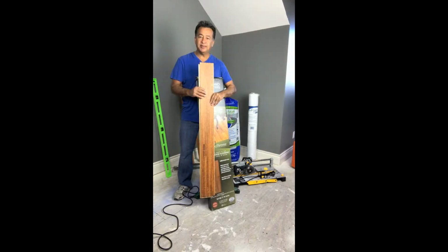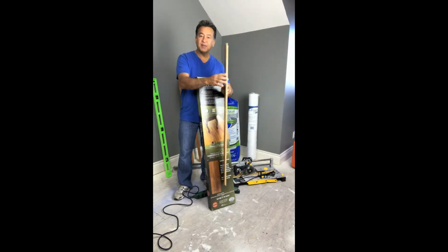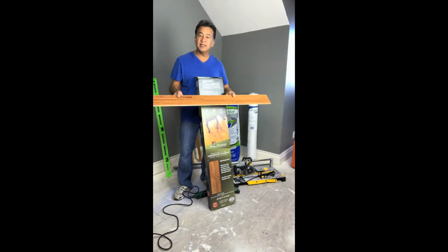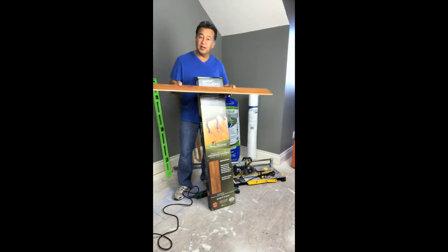The diamond wood planks are constructed of butcher block pieces of solid German white oak, all glued together like a butcher block. The plank size is 5/8 inches thick by 5 inches wide. This flooring is a click flooring, which means that it floats. Basically, the front clicks and the end joints just drop. So the end joints is a drop lock system, the front is a click system. The flooring is recommended always to be a floating floor, but it can be nailed and it can be glued. But today, for our installation purpose, we are going to float the floor.